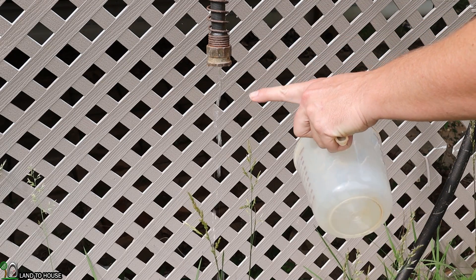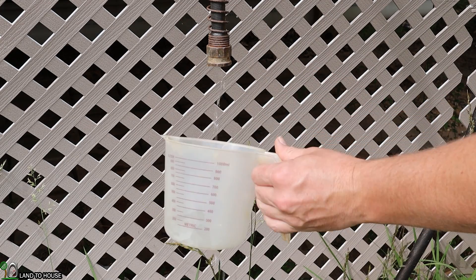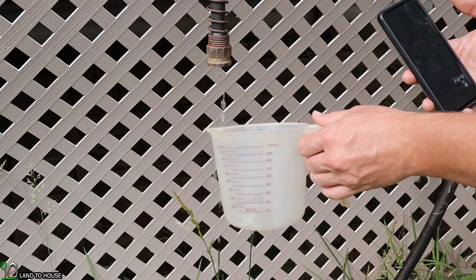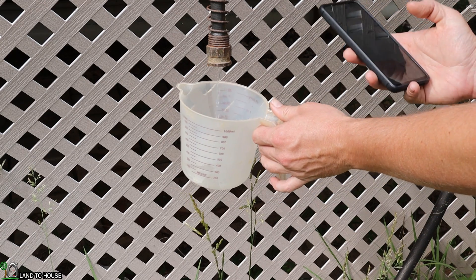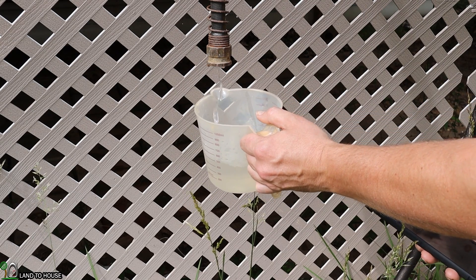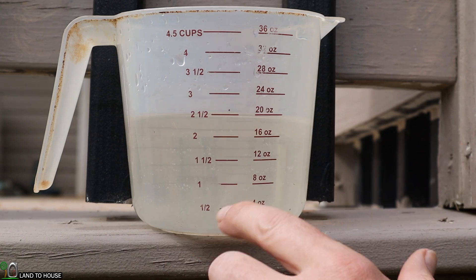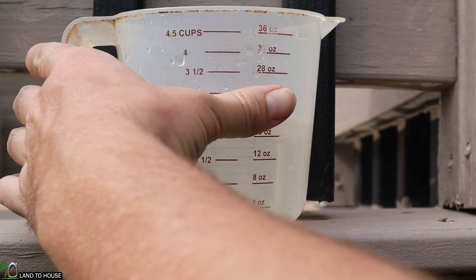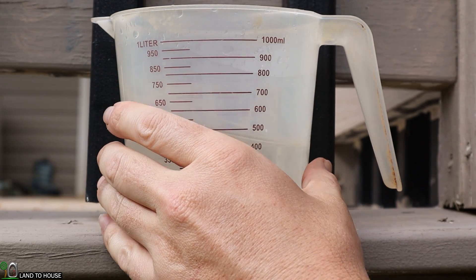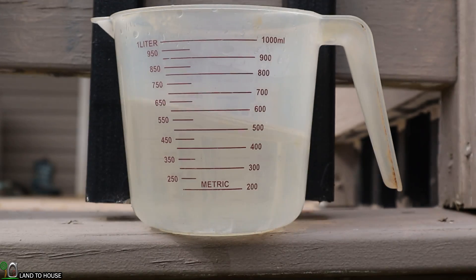Let's go up and measure the output without the inline valve. Here's the output of the ram pump at the very top of the garden hose — this is approximately 20 to 25 feet above the pump. I'm going to use this measuring cup and a timer to see what water we get in one minute. For the sake of consistency, I'm going to use this location to measure both with and without the inline valve. Without the valve, I've got two and a half cups or 20 ounces — looks like right at about 600 milliliters. That's without the inline valve.